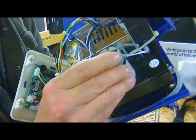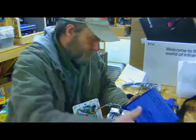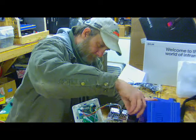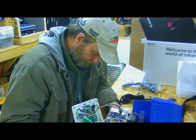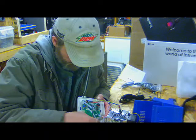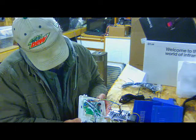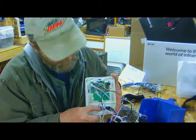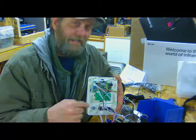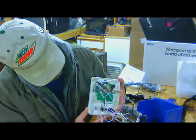What kind of a crock is that? I'm gonna go through this whole thing and dig through it and see if I can find anything else that's gonna come out and explode at me. Yeah, the back connectors, plenty of hot glue around it. Yummy. There's ground wires going up here and they look like half-ass crimps. Good enough heat shrink on the switch here. Looks pretty decent. No. There's heat shrink on all the wires going down the connector here, and I can see wire poking through the heat shrink to the wire right next to it. The chances are, you plug this in and bzzz. So I'm going to take all those off and redo those. What a crock.